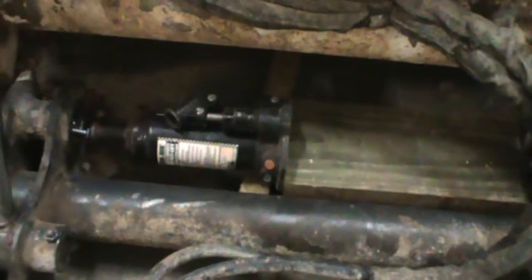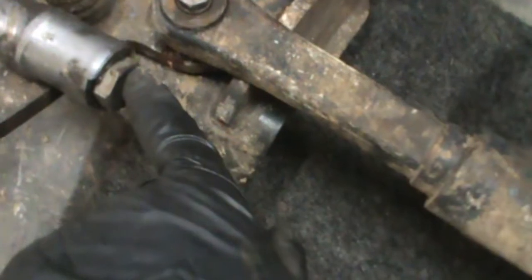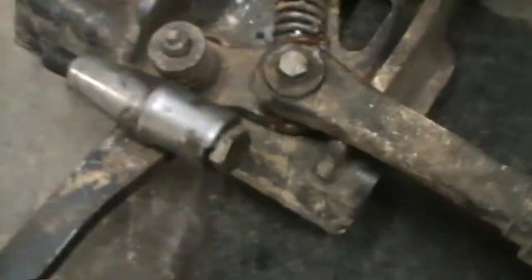Another quick view. Just put a piece of wood from one side to the other. Put the jack in there. Jacked it up. Just enough, it doesn't have to be much pressure. Just enough so that bolt would push that head into those shoulders. And you can take your nut off this outside, out here. And it worked. Worked really well. So that might help you be able to get that out. So, anyway, there you go.